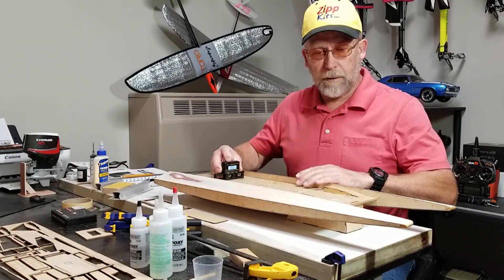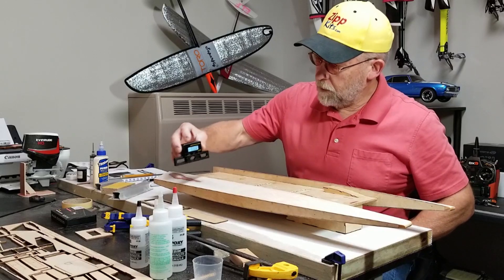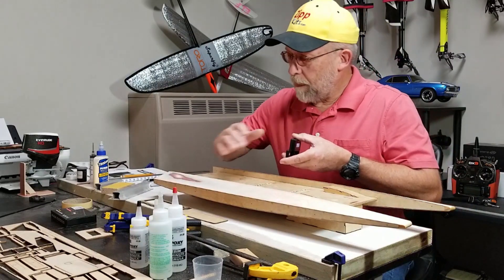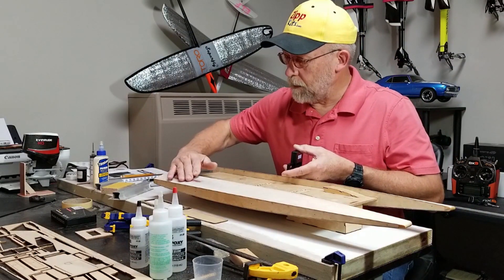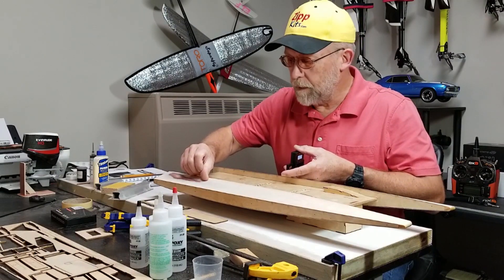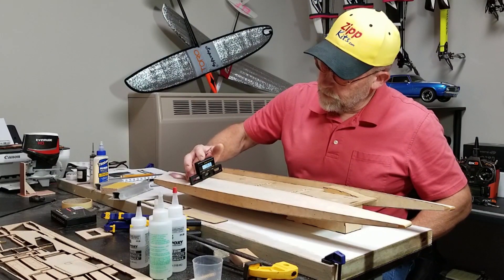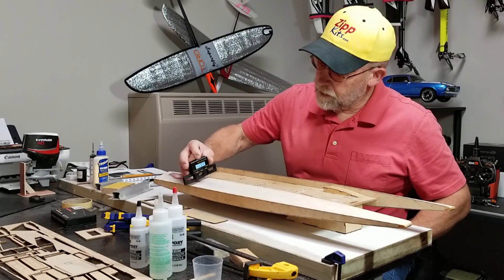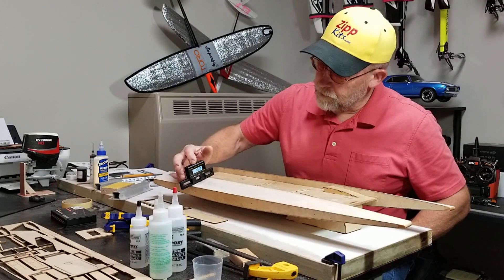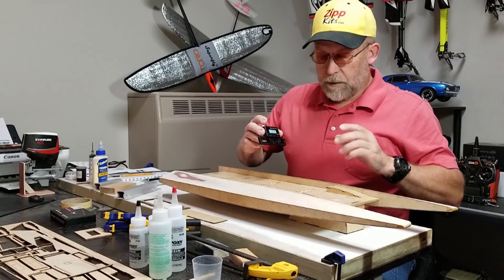Back to the G30 and why I showed you that. When I show an angle like this it should be around 17 degrees. I sanded this — you can see it's got a little bit of twist I'm taking out — but right in here it's not touching my sanding block. If I put the gauge here it's down under 16 degrees. So I'm blueprinting this area and I'll get differences in the reading just from slightly rocking this. I started on this side.